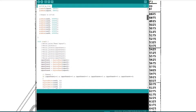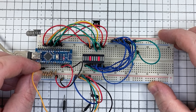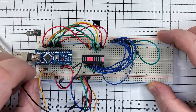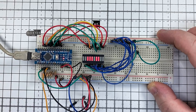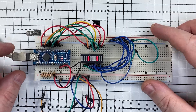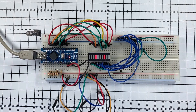Once I'd done that, I had built it onto a piece of breadboard, and this is what happened. Here's a quick demonstration: when you change the inputs on the analog inputs, it changes on the 8 LED outputs. So in theory this should work — I've got no reason to suspect it won't, because the LC chips will take 5 volts. There are some pull-down resistors to stop the Arduino going a bit mad.